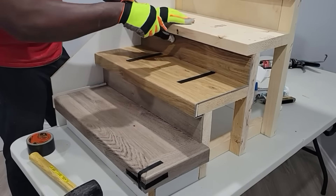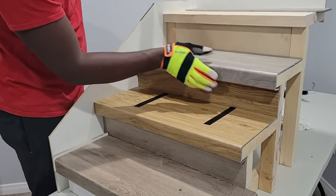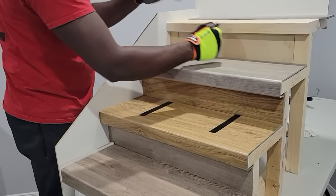Unlike with the loose lay, we are not going to be adding it afterwards, simply because of that clicking system. We need to make sure that it's clicked in place, and that's quite difficult when you're trying to deal with that tight space at the back there. So we've clicked it into place and we're going to be sliding it on. We have videos specifically about how to do that clicking when you're dealing with a particularly long stair, or just the little tips from doing it all the time that make it a little bit easier. You're just clicking it into place, adding the glue, and sliding it into place. Then you're going to be adding a riser — these are just made out of the exact same vinyl. You rip them lengthwise, cut them widthwise till they're the right size, and then add the PL glue to be putting them into place.